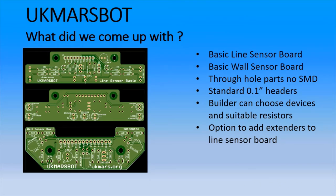We've also provided with UK MarsBot some basic starter sensor boards so that you can sense a line or sense walls in a maze environment. We followed the same principles — all through-hole parts, no SMD, all on standard headers — but the builder can choose the devices they want to install. There are suggestions in the schematics, but you can choose whichever devices and resistor values you want. A 14-pin connector connects back to the main board of the robot, and builders can do what they will in terms of making a board that connects via this 14-pin connector.